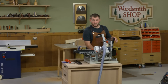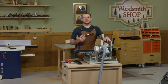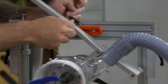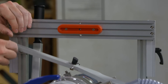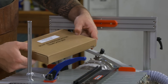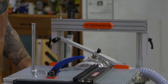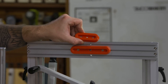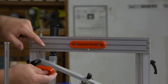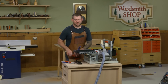The first use everyone loves to see when I demonstrate this at local guilds is mortise and tenon - this thing is an absolute mortise and tenon machine. It does a great job of letting you sneak up on a fit using templates. There's a whole box of slot mortise templates available, with molded plastic holders containing standard mortising templates that work in both vertical and horizontal positions, each with corresponding registration tabs to fit the aluminum channel on the template holder.